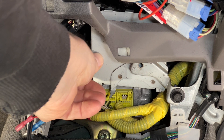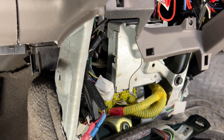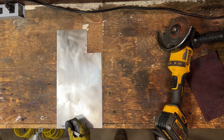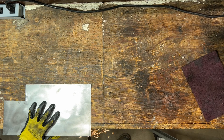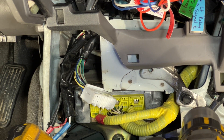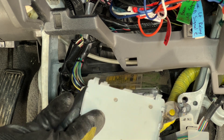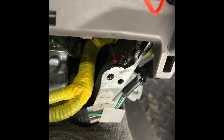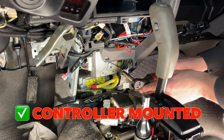I noticed the mounting strategy was a little flexy, so I'll need to weld gussets to both the mounting tab and the bracket. I took apart the controller to protect the circuitry inside, cut off the mounting tab flange to make it easier to bend by hand. With a bit of trial and error, I bent the mounting tab into a shape that utilized the bolt and kept the controller in the right location. I cut out some steel to reinforce the controller's mounting tab, drilled a hole in the bracket, and put a pin on the mounting tab as an anti-rotation feature. Step 3 complete — controller mounted.